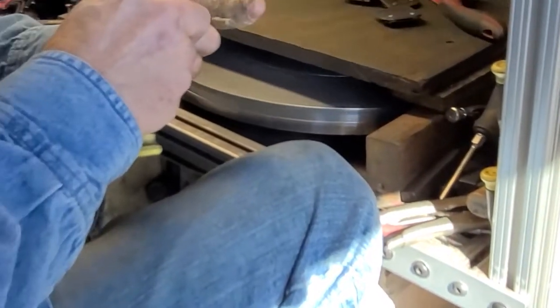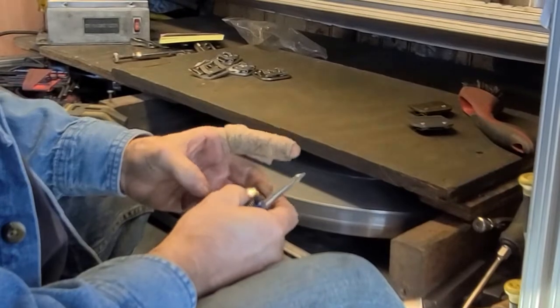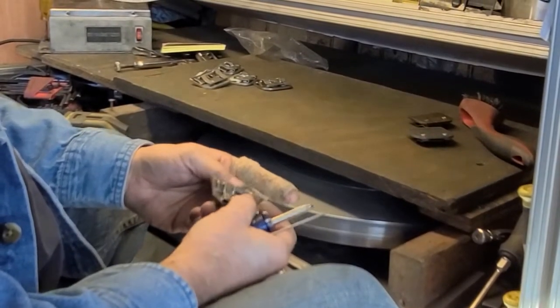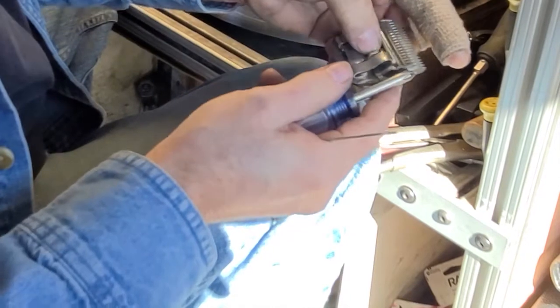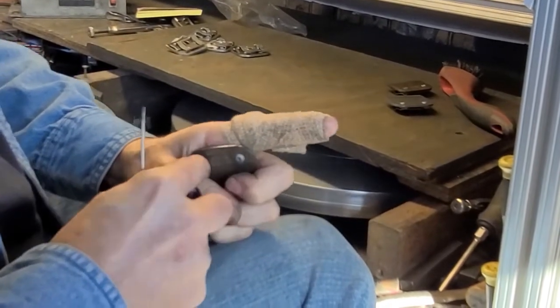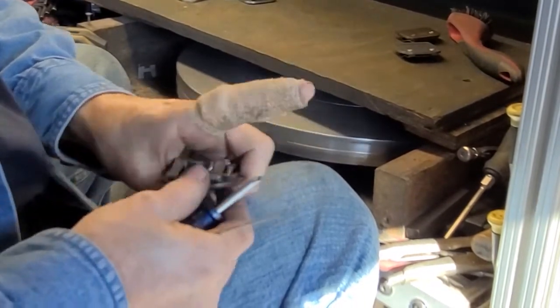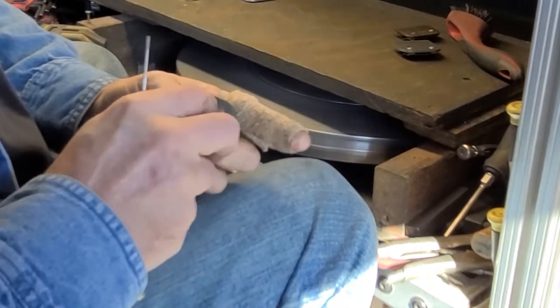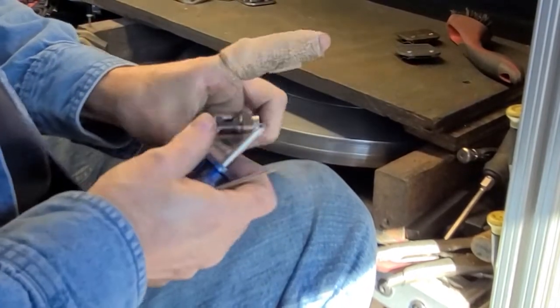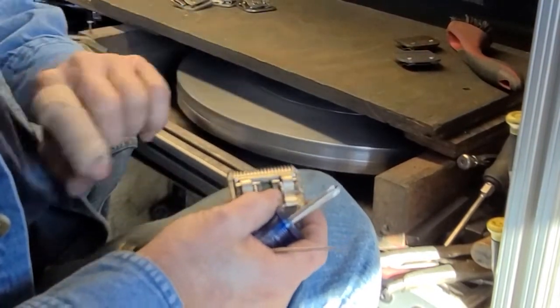Okay. And when I first started checking all of these, I used a little tool that Jason at the Edge Pro sells. Okay. This one, I'm hanging off a lot right here on both sides. So I'll loosen that up just a little bit. Maybe a little bit more. And one thing that I do recommend is when you're setting these, push the blade back and forth so that it sets down correctly in the guide. Okay.